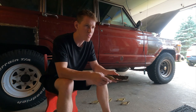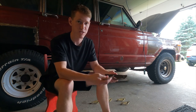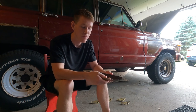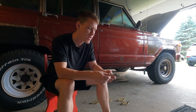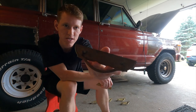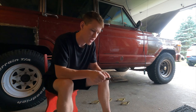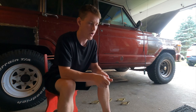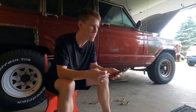There's no really specific grit — sometimes you have to experiment depending on the type of hardware you're refinishing. For this case, I used 220 grit because that's just what I had on hand. Here's what the piece of hardware looks like before I scuff it up using some sandpaper. You can also use a Scotch-Brite — it's kind of like a wiry, sponge-looking thing — to scuff hardware.